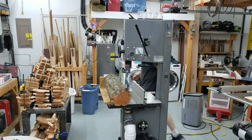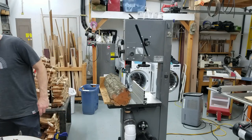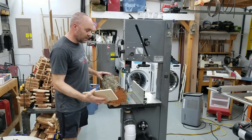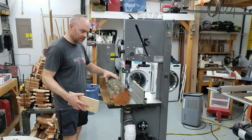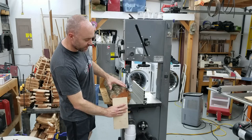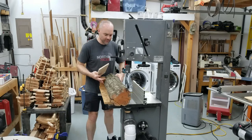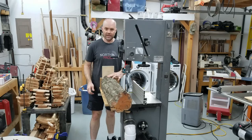Nope, I almost forgot one thing. You also have the option of taking a small piece of plywood, this is not small, it's too big, but if you want to cut at a certain angle, like if you like the grain a certain way, you know you're going to get a better cut if you rotate the log a little bit, you can just take a small piece of plywood and tack it onto the back. And that small, I mean like that big. Just something to help this side lay flat on the jig so that you can push it through, if that makes sense. So this one would even work. I would just pull this off, figure out which way I want it to stay, set that down, put one tiny little tack or a screw through there, and that way it wouldn't rotate.